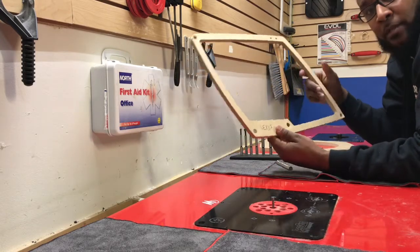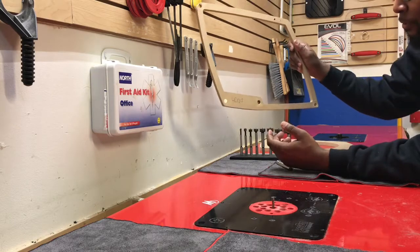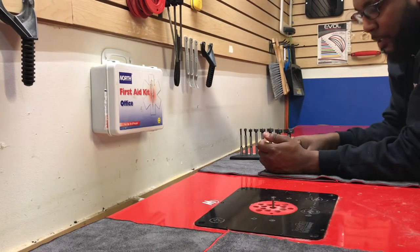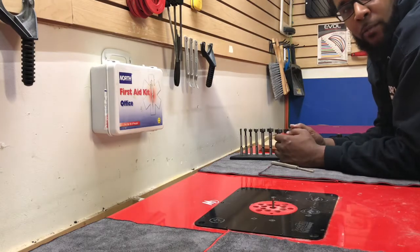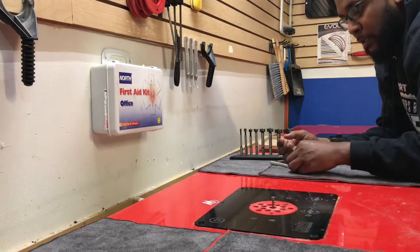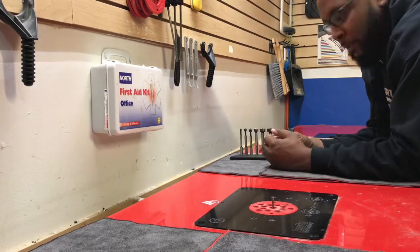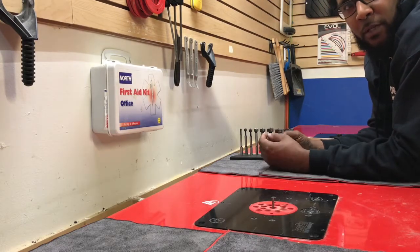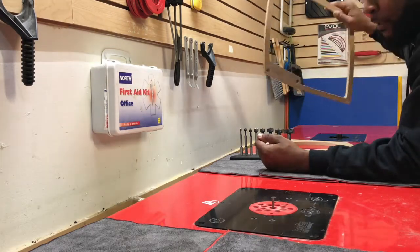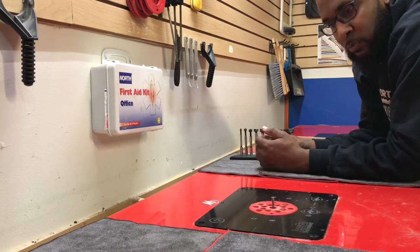Just as another tip: if you have the time, make a sacrificial piece, pre-drill where you want your magnets to go, and then line it up against your template to mark all your spots. This is not the only way to do it, but it's the way I do it. It takes a little more time to make that sacrificial piece, but in the long run I never have any issues with magnets not lining up. I have the actual template so I can go to the left side or right side and everything will always match up.